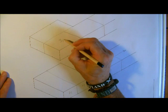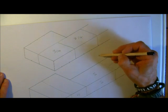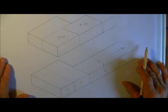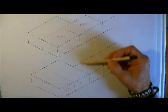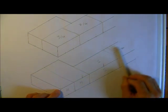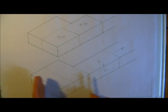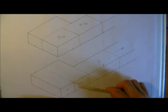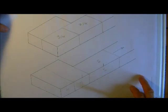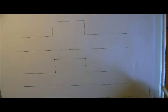On the back of this wall we will have a whole brick again. But because of this joint we have here we now want to have a three-quarter. And another three-quarter there — so we will have a three-quarter and a three-quarter. Then that if we bring it down is back to half bond. So you can see that when this comes down to here, this three-quarter is sitting on there, so we have got a nice half bond along the wall. And then when we come to the end pier here all of a sudden they bunch up into quarter bond and we get a zip up where the pier is — so visually not a great thing.